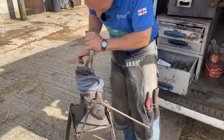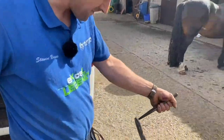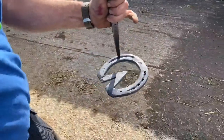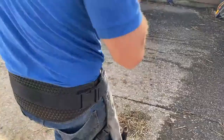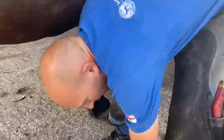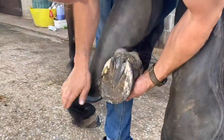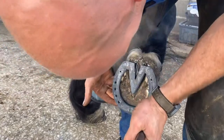So I've got his roll off the toe, I've got roll off the heel, so that's nice on the back, toes rolled off, I've got plenty of heat there. At the moment I'm going to the foot with the frog plate flat, and then I can always add more frog pressure to it. The way I look at it is I've trimmed level with the frog, so I should be pretty much there. So try it on.